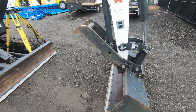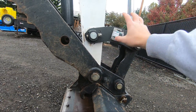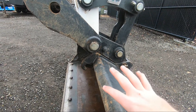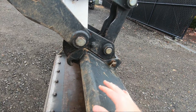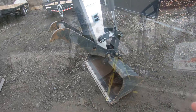The reasoning is, as this bucket rotates around, this dog bone is rotating at a slower speed than this bucket. So it needs the wizard mode to be able to figure out where this bucket is as it rotates. If the sensor was on the bucket itself, it would rotate at the same speed so that you could use the manual method. So I'm going to go through and finish with the wizard method, and then this system will be all set up.